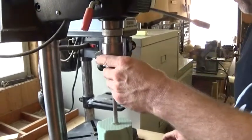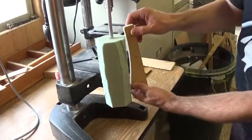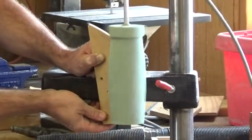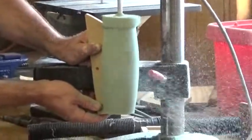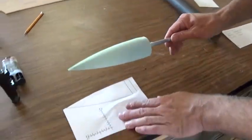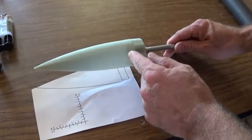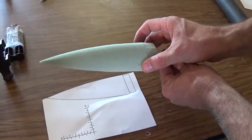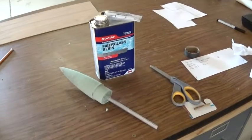I'll chuck it into the drill press and then use a piece to push against it like a lathe and shape it until I get it to the right diameter. Here's how it came out off the drill press. The piece is actually longer than needed, which is good — I'm going to carefully mark and then hand-sand a ring around it to make the shaft area smaller so it will fit into the rocket body tube.